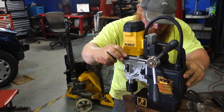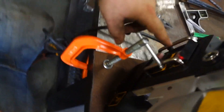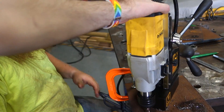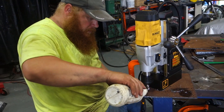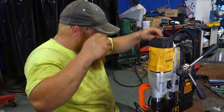It's an electromagnet — damn! And it won't run unless the magnet's engaged. It's serious too — it's like 1,500 pounds of magnet. It won't drill unless it detects proper contact. On something like eighth-inch material, it won't work. And it won't do anything with aluminum either. Unless you put a block of steel under it, and then it could work.